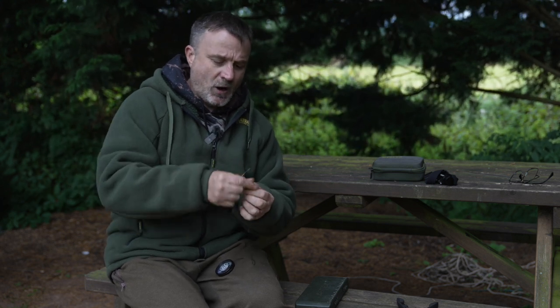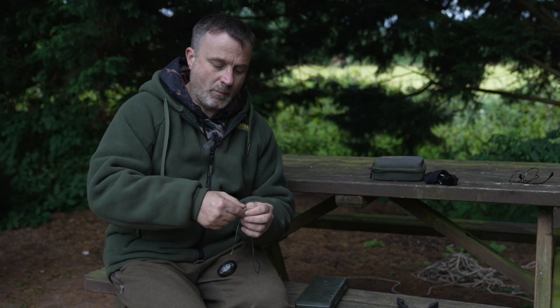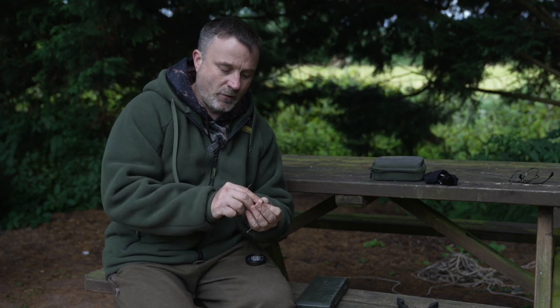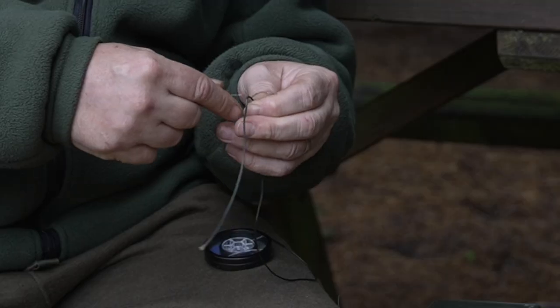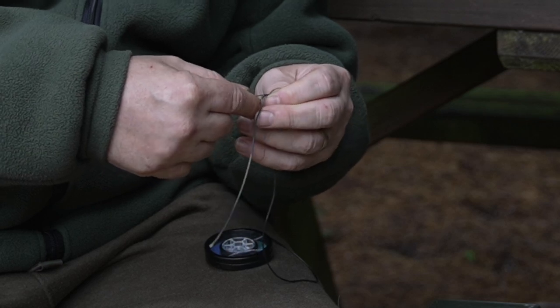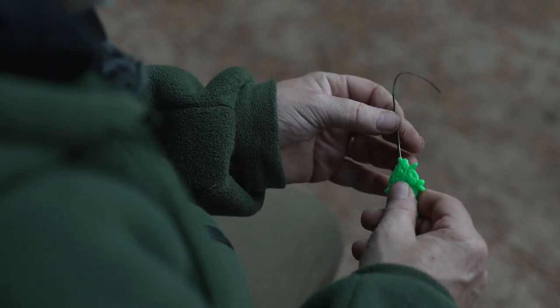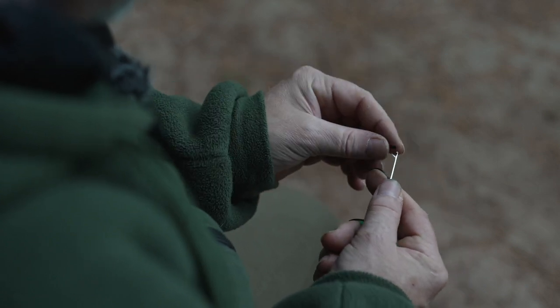The only difference is I've found where the chain finishes. Normally with lead core you'd go in where the lead core finishes and start your splice. Now if you do that with chain core, because it's such a thick chain, what you can end up with is a flat spot from where the chain finishes and the splice starts - which won't cause problems but it's unsettling. So what you need to do is find the chain, go back maybe five or ten millimetres, and then take your needle and go in alongside the chain. It can be a bit of a fiddle but once you've done it a couple of times it's fine.